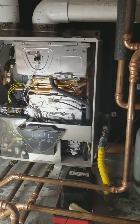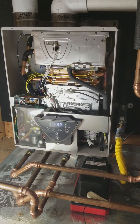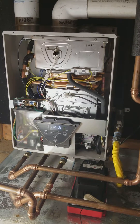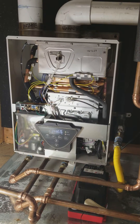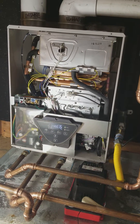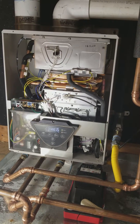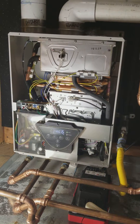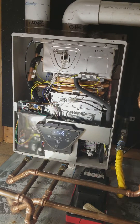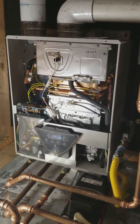We've been pretty good with these machines up to approximately 3,000 square feet zoned out with one of these 199s. If you're going to do fan coils, I wouldn't go anything greater than two zones doing your domestic hot water — if so, you're going to have to bump these things up to max and make them scream. But in all the 15 years I've been doing this, knock on wood, no callbacks.